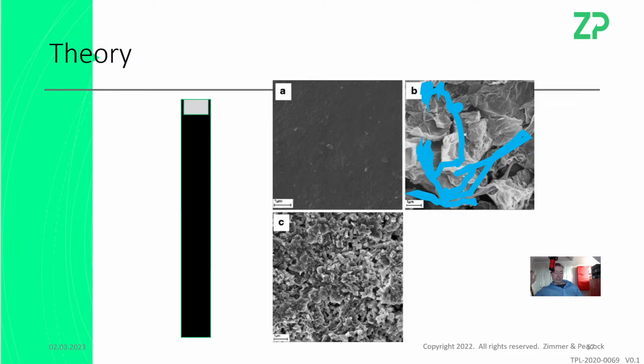How to fix it is a question. Well, to be honest with you, I don't know what solvent they are casting in, but clearly their polymer was initially soluble in that solvent, so sort of soaking it in that solvent. But even then, I suspect that it's going to be very hard to get it out. So I don't think it's the carbon itself. I think there's residues of polymer getting into that surface, and they're not getting it back out again.